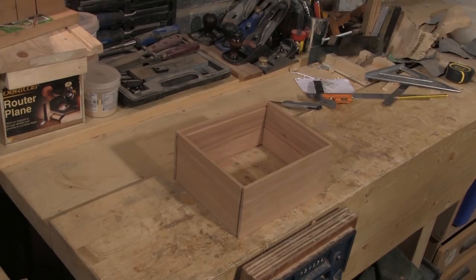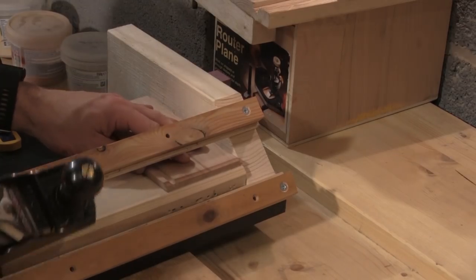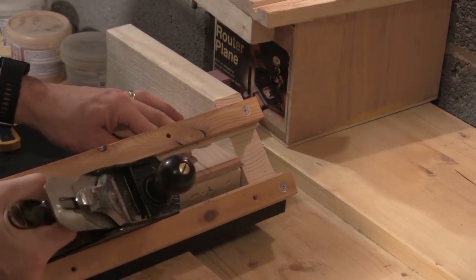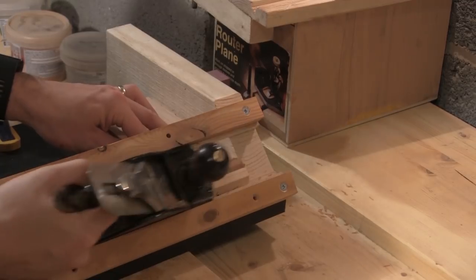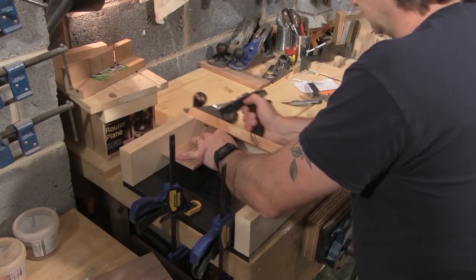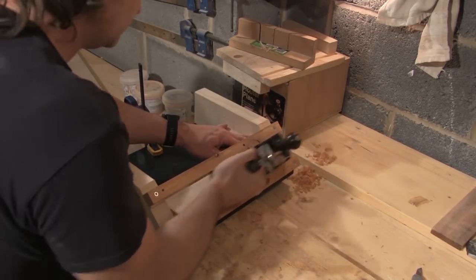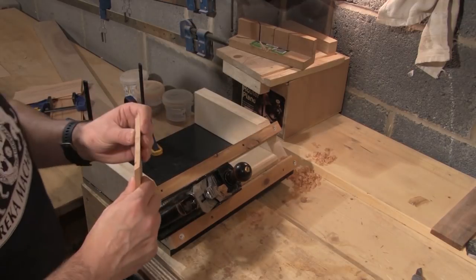These boards currently have square ends, so we're going to use this jig to cut 45-degree mitres along each edge. The jig is essentially a shooting board that angles the plane at 45 degrees. By moving the plane along the guide and feeding the work into it, we cut a 45-degree angle on the edge of the board. On my channel you can find a video showing how to construct this jig using hand tools only. I've set my plane to make quite a shallow cut, which makes everything neat and predictable. I've clamped the jig to my workbench for stability and keep feeding the job into the plane until I've cut a 45-degree angle right across the edge.